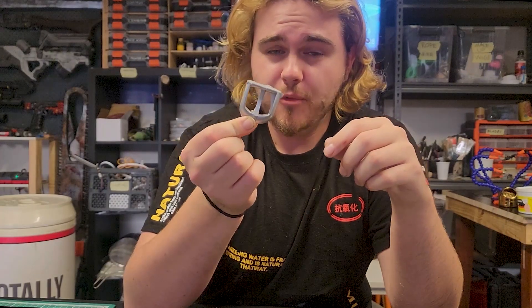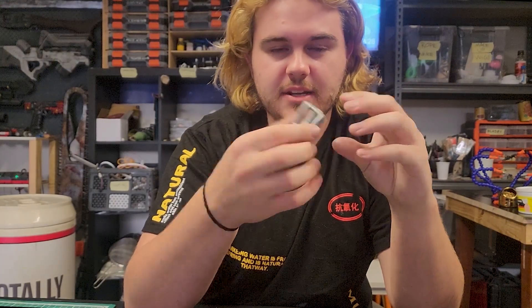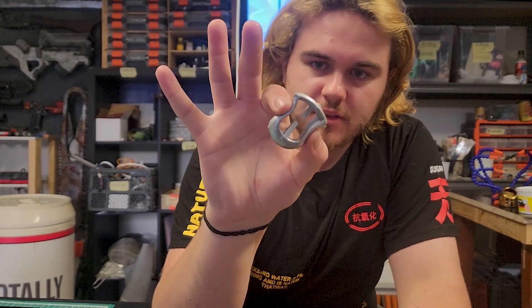So instead I have to go the more expensive route with high-end flexible polyurethane casting materials. Here's another test I did — a resin called F170. I think I over-pigmented this one, which is why it's splitting a little bit. But as you can see, it squishes — it's flexible.